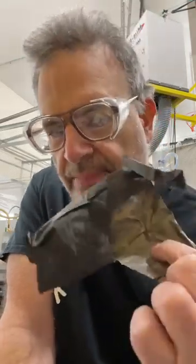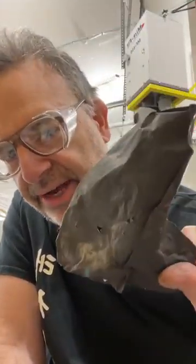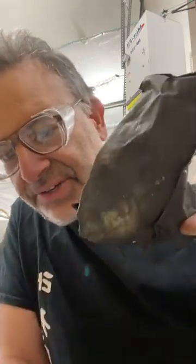How does it know inside versus out? Is one side a different finish? I'm using the pre-made bags, so inside and outside are obvious. But there's no inside or outside to the material. It's not like one side has a special coating. It's the alloy of stainless used in the bag that is scavenging the oxygen. So when they come out, look at the outside of the bag. Do you think that had an oxidation reaction?